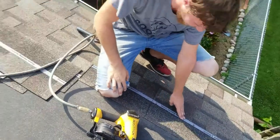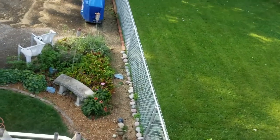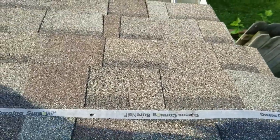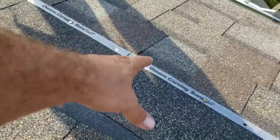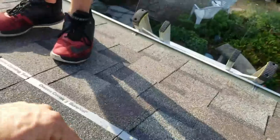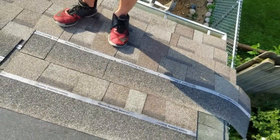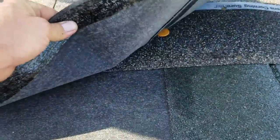Wait — that was the next trick: what else you have to watch out for. Some people might think I'm crazy but if you can avoid it, why not? See how close that nail is — he wasn't paying attention to where he nailed, so very easily he could have had a nail on that seam. Whenever you put this little 12-inch piece in to meet the end of your rake, your nailing pattern gets screwed up. You can even put a shingle up above just to see where your seam is going to land, put a nail there, then skip out to your end. That way you don't land with a seam too close. This little hole here won't cause a leak because underneath it is a shingle.